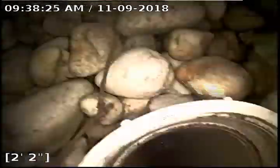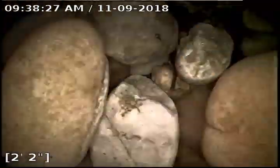Alright, so this is 105A, and what they did is they put a sanitary tee on its back. So we can't get the camera to go either way. We saw where this line comes in when we did 101A and went all the way out towards the main. So that's an AC drain, 105A. Alright, I'm going to conclude the video. This is the left side of the building.